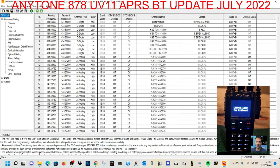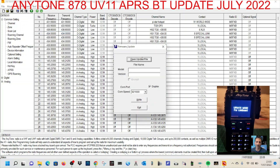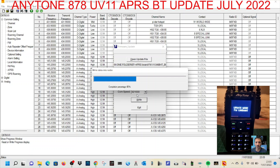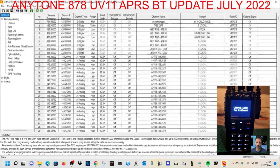With the radio in update mode, go to Tool, then the Firmware Update icon. Click Open, find the file you saved — mine is saved as 'BHT Board' — double-click it. You'll get 'Open Success', click OK, then click Write to the radio. It's very quick. Write complete — click OK and you're done.